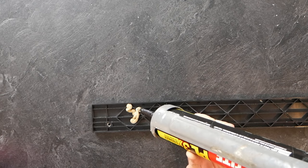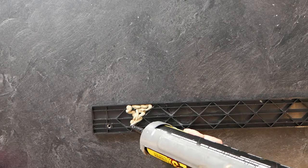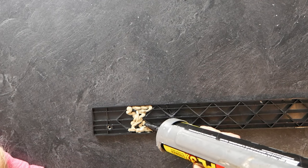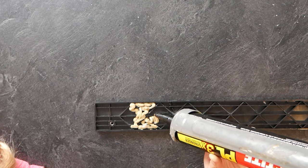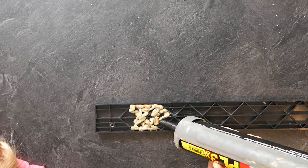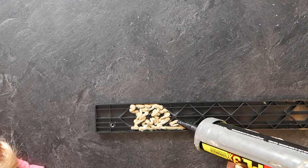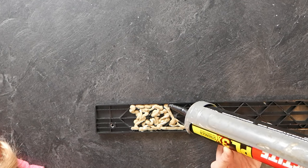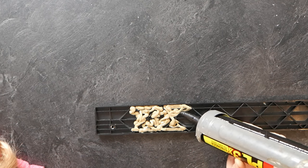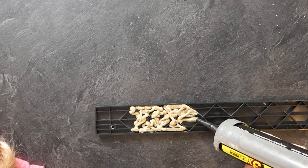It has a long open time. Do you know what an open time means? It won't glue into your fingers. Kind of. It's how long you have to work with it. So normal construction adhesive that's solvent based, when you put it down, the solvent evaporates and then it gets a skin on it. And if you don't bond your two pieces together after that, it doesn't really stick. So sometimes when people build a house and they have squeaky floors, even though subfloor adhesive was used, it's because the crew was not paying attention and they put the glue down too far ahead of where they were working. And that caused it to get a skin on it that never eventually bonded. This won't happen.